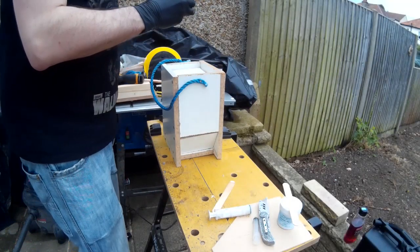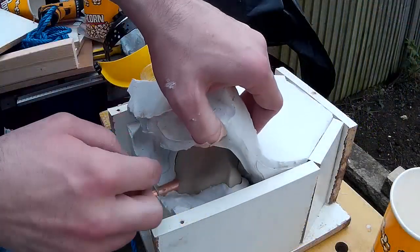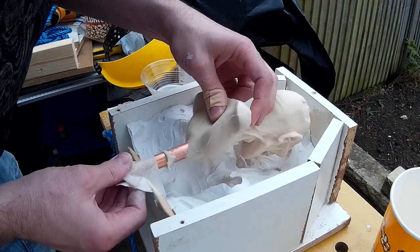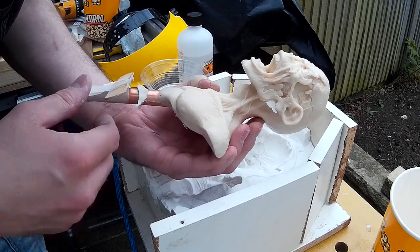However, if we're talking about two-part moulds — for example here where I'm casting a zombie sculpture — this one definitely would need pressure casting. Simply because there isn't as much room for the air to escape, and also because there's some fine detail in the sculpture itself.